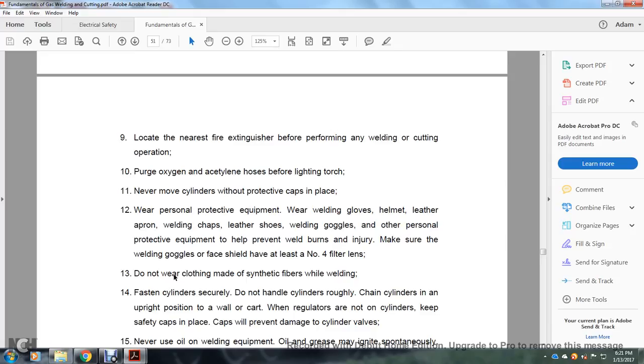And locate the nearest fire extinguisher before performing any welding or cutting operation. Purge oxygen and acetylene hoses before lighting the torch. Never move a cylinder with the protective caps removed. Wear personal protective equipment: welding gloves, helmet, leather apron, welding chaps, leather shoes, and other personal protective equipment